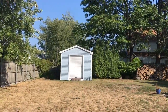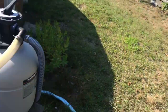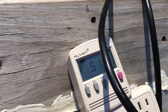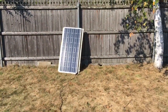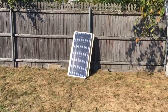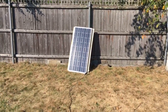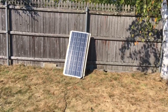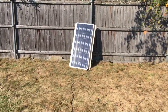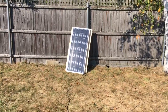For right now it's just a sunny afternoon in September, so I set the panel up to save a little energy. At four o'clock we're pulling in about 52 watts — not a lot of power, but it's something. If you're looking to do a simple portable system, this is one way to do it. You would need a different inverter and a charge controller if you're trying to charge batteries — this is a grid-tie setup sending a small amount of power back into the house grid to cut down on what we pull from the electric company. Thanks for watching.